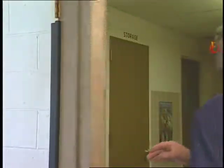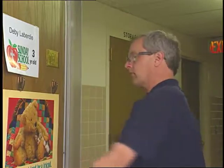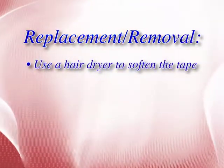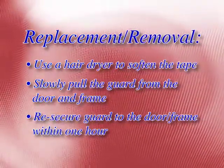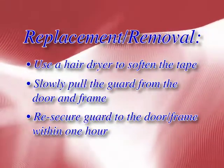These protection guards are basically maintenance-free, although we recommend that you check them regularly. If it's ever necessary to replace the tape or remove the guard for servicing hinges, use a hairdryer to soften the adhesive tape and slowly pull the guard from the door and frame. You may re-secure the guard to the door frame if done within an hour or so.